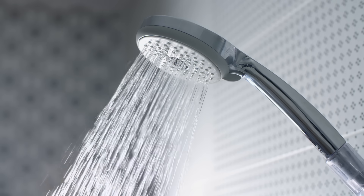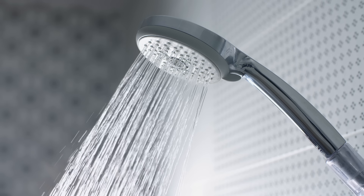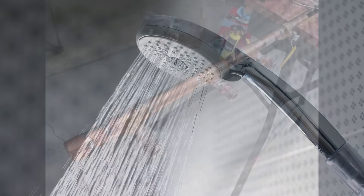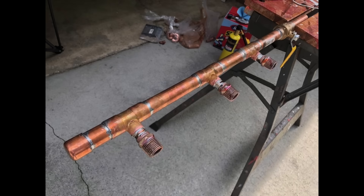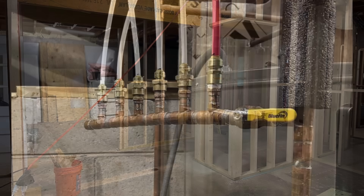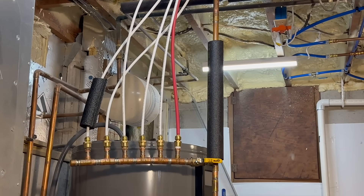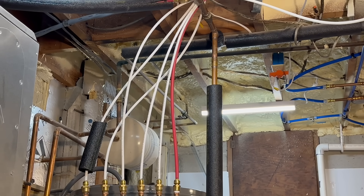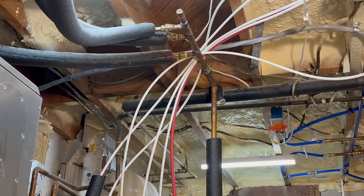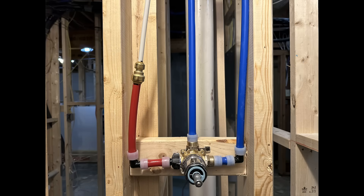The retrofit I did on our hot water system in 2022 was great. It made a huge improvement and made those three fixtures way less painful to use when we wanted hot water. But I realized afterwards that I made some mistakes that could have made the hot water get to those three fixtures even faster. We're in the process of remodeling our basement right now, and I'm using what I learned from those missed opportunities to make the basement fixtures even faster by doing the same thing down there — a new manifold running PEX tubing with small diameters directly to the fixtures.